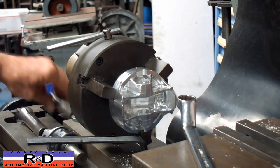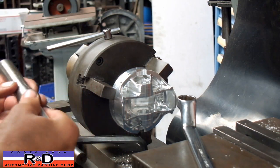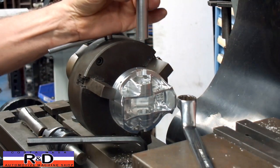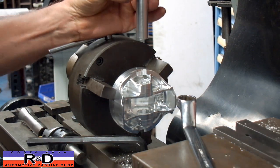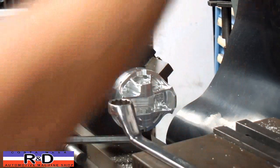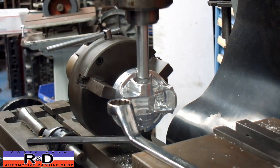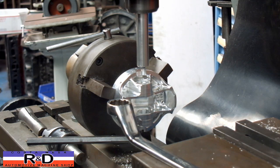In hindsight I should have made the pin alignment tool three-quarters of an inch instead of eleven-sixteenths. If I try to line this up right now it's not going to work because I haven't lined up the piston for the fifty-thousandths offset. So we'll pull the table over fifty thousandths.